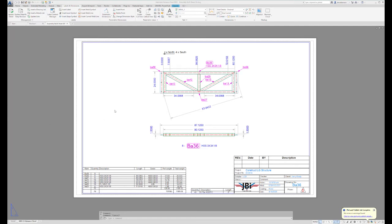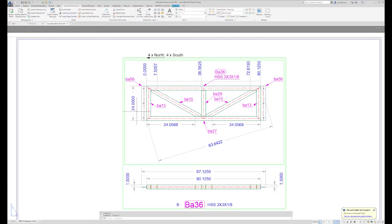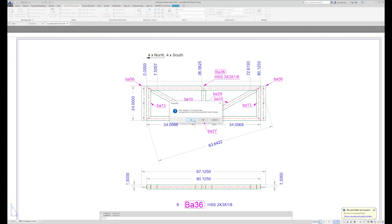Alright, let's review the corresponding assembly drawing and go over a couple dimensions based on what we just talked about. So we decided we were going to set our primaries, which is this part and this part, and we were going to set them to a width, which is this dimension, 24 inches. And then we needed to set our diagonal dimension, and cross diagonal dimensions would be the same. Therefore, I only need to put the diagonal dimension on my drawing one time. Putting another diagonal dimension on the other side is redundant, and it clutters the paper more, and we want to keep it as clean as possible, especially since we all know the dimension is going to be the same, 83.642. That being said, we'll go back to the model and talk about the next phase of laying out the assembly in the shop.